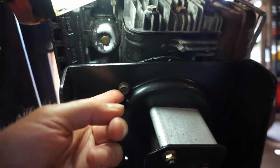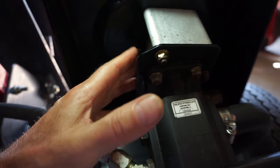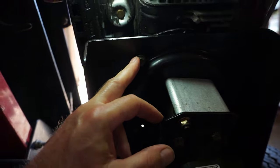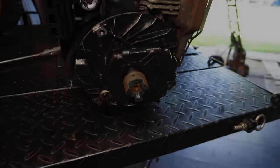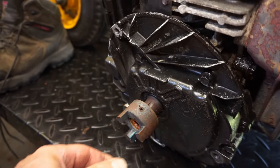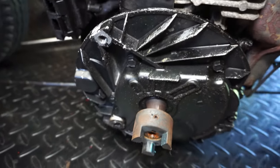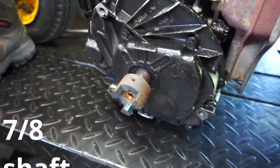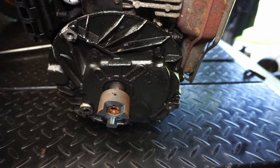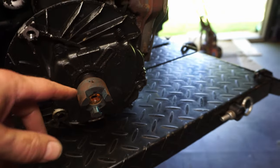These are the engine bolts and this is the lower mount for the pump and drive system. We're just going to take these three bolts off and pull the engine. It came right off - but here's your problem: you can't just put any motor on this. It's a short shaft and it looks like it's not the one-inch or three-quarter shaft - it's the smaller one. This is what you'd find on a lot of pumps, like pressure washers.